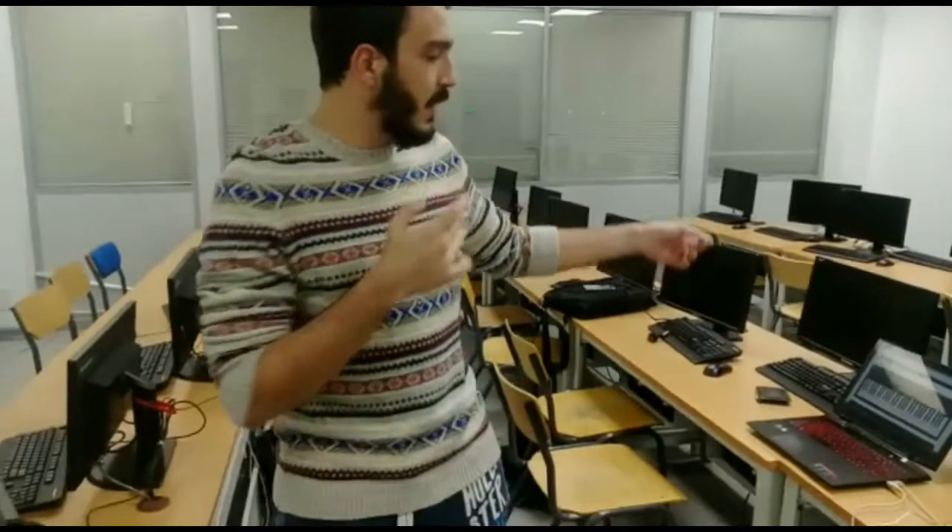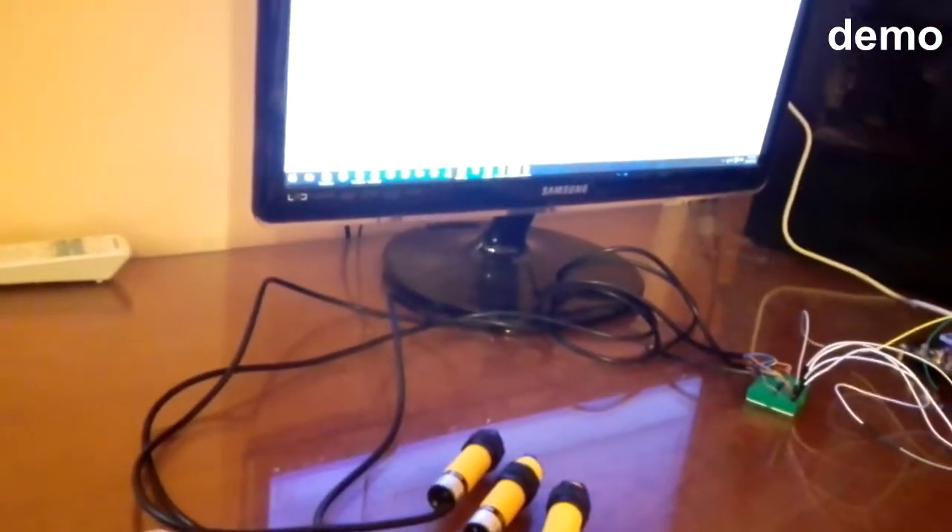The library triggers the buttons, and the buttons then trigger the virtual piano. Now I'm going to try the serial reading. It reads zero from the board because the sensors are off. Now I'm going to try to put my hand on one of them. Only one sensor is working — it means one. The second reads two. The third is four. Just like reading binary.